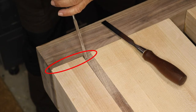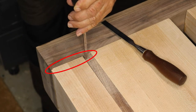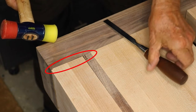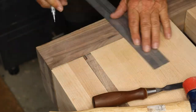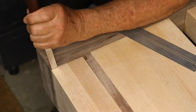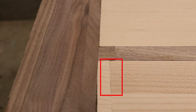For a really small gap, sawdust mixed with glue would be the normal plan A. In this case I'm going to go to plan B, which is to even out my flaws and then replace them with little pieces of wood. Some creative chisel work to make large enough cavities for the new wood to fit into — but it was even much worse than the original problem. This is wrong in oh so many ways, so let's go to plan C.